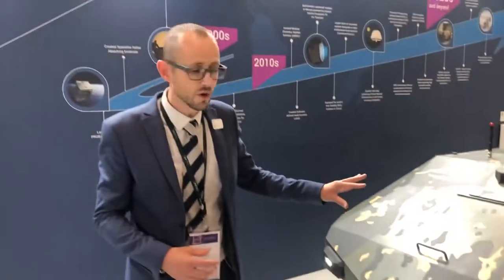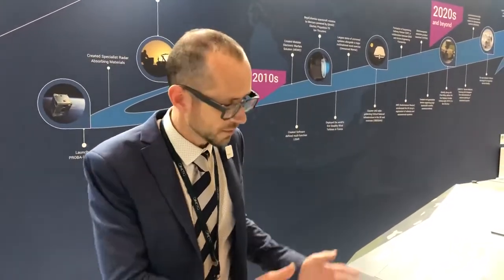One of the many novel features of the platform is this adjustable wheelbase. We can reconfigure the wheelbase — we can have a long platform that's very stable, or a short platform that's less stable and that uses that instability for a higher degree of manoeuvrability and agility. We've also got independent steering on each of the eight wheels, enabling some interesting agility-based manoeuvres.